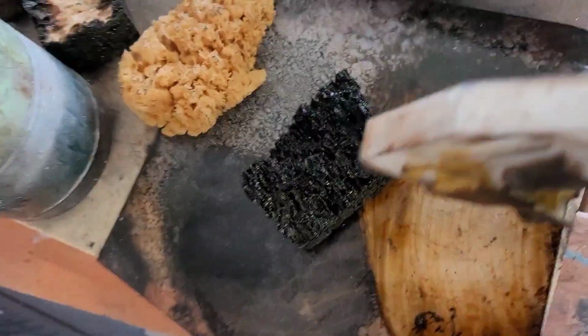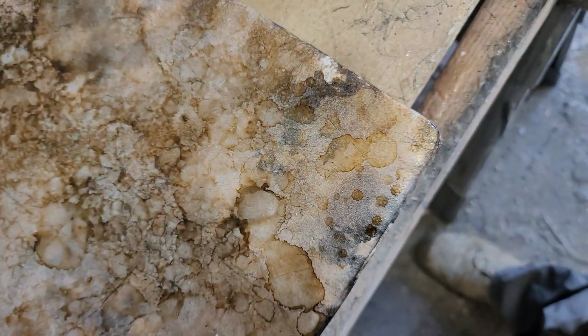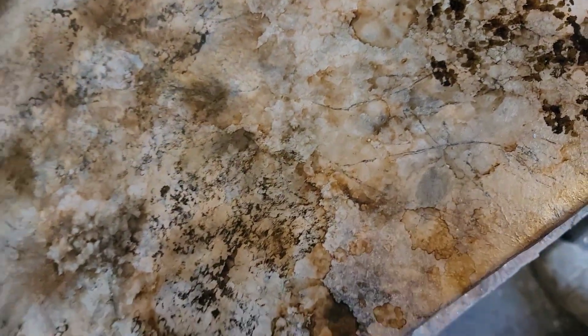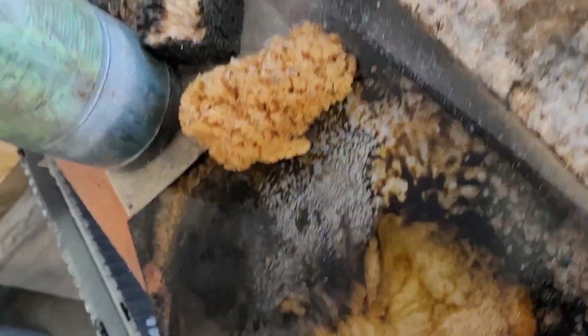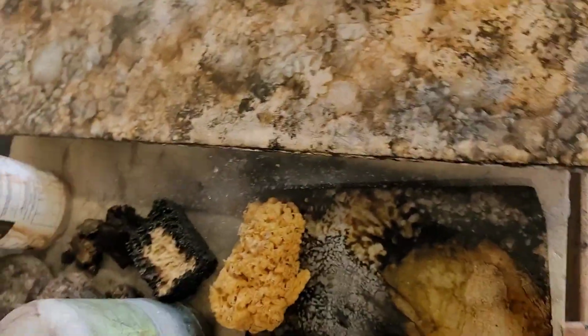And we can also spray our sponge to reactivate the dye that's already in it. So let's say this area down here, right? Doesn't look quite natural, so we're going to bring it up very lightly, fade it. Doesn't matter if it runs a little bit, streaks a little bit on you. Looks like hell, but as soon as we hit it with a little bit of alcohol, that's all going to change. That looks pretty good.